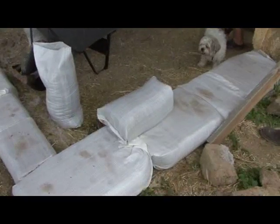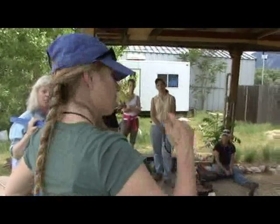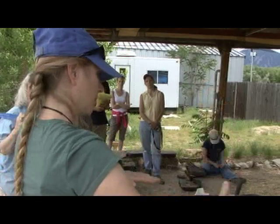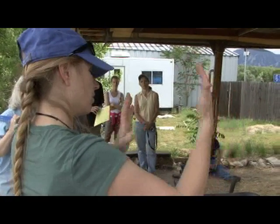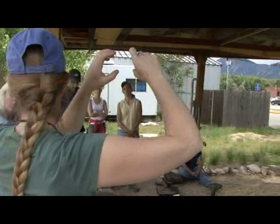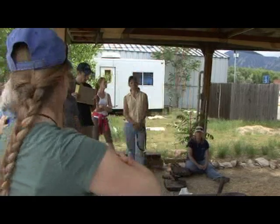And you would really continue until, let's say, you needed a window. Then you would place your window buck, your rough buck for the opening, and build the bags up and around that. Or you just have a space held and then be putting a lintel to carry the load across that opening and above that opening.